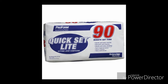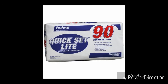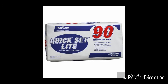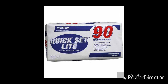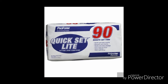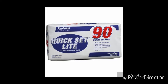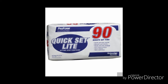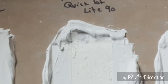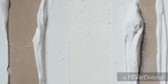A more readily available product is Quick Set Light, as opposed to the brown bag quick set — this is probably more comparable to Easy Sand. However, I find if I use it to build coat after the tape layer, it smooths out a whole lot better off the trowel than Easy Sand does, and it sands just as easily. As you can see in this test, it sticks the tape just as well as quick set. Looking down this tape seam, you pretty much see only fuzz — there's nothing where the tape has actually come off clean.